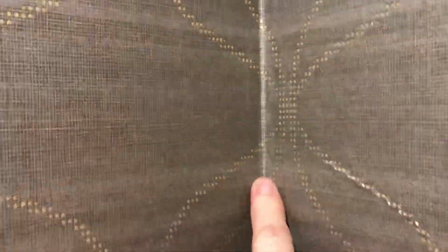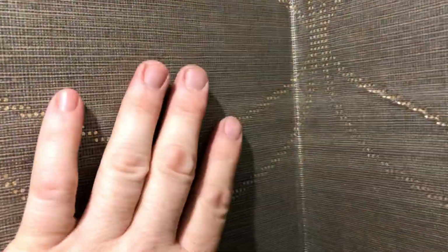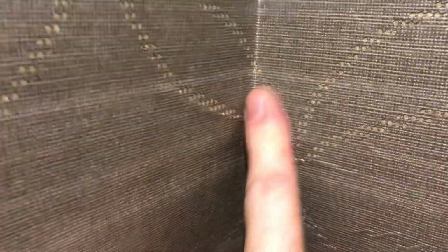All right, now, show them that seam. Nice and slowly up and down that seam. I don't like the angle you're showing them. Let's get it better. When you show an angle, let's get it nice and close, because otherwise, you're not showing my weaknesses or my success. That's what I want them to see, just like that. Right. So you see how beautifully it fits? I mean, look, as paper hangers, we're perfectionists by nature. You don't want to cut this. But sometimes you have to, just to make sure that you can get it in there without any buckles. And this is still an issue. I don't like that. But that's from the wall being off. I've got to work that out.